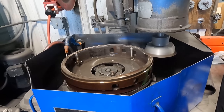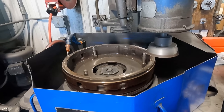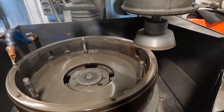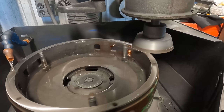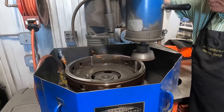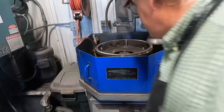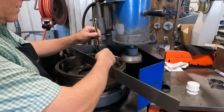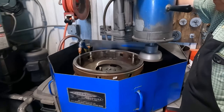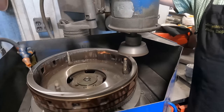The upper step of the flywheel now has to be machined to account for the material that was removed from the wear surface. The clutch pressure plate bolts up to this surface, and to put it simply, if the distance between these surfaces is too large the clutch will have poor engagement and slipping will occur, and if the distance is too small the clutch will be too tight and it won't be able to retract fully. After a bit of grinding, dad uses a straight edge to measure the distance and see where we're at. He measured a distance of 2.874 inches, which is well above the specified tolerance of 2.839 to 2.849 inches.